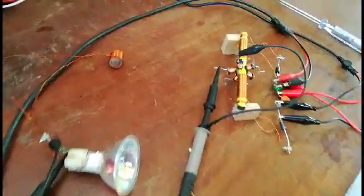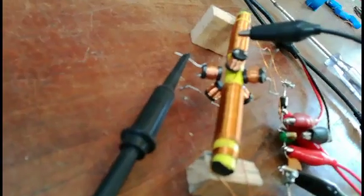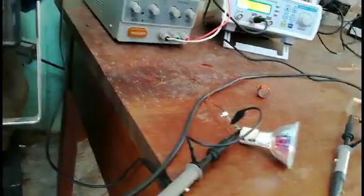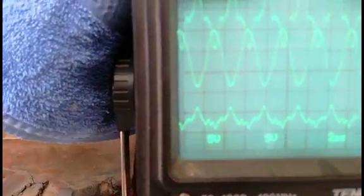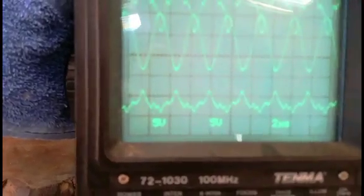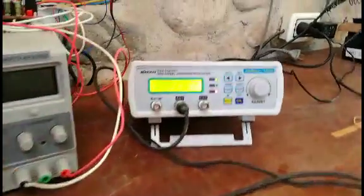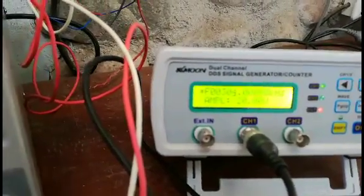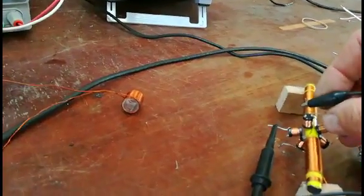So now I have changed the secondary for this setup of small ferrite cores, which are coupled in series. This is the trace below. It is now exactly in the center, and I have 5 volt per division. The resonant frequency went down. It is dependent on the secondary coil, evidently. Now I've got 304 kilohertz.